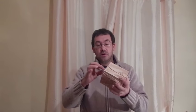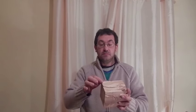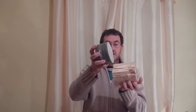And then I'm going to bring it right down to a small pin, about half the thickness of my blank, which is the same size as the center of the CDs. And then I'm going to push this onto that and glue it halfway onto the block. So there'll be like a dowel through the center, and then glue it. So you've got a lot more surface for gluing, okay?